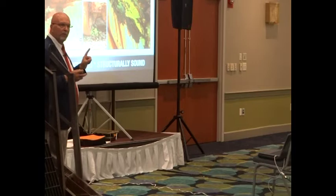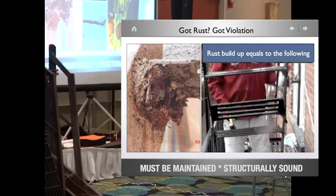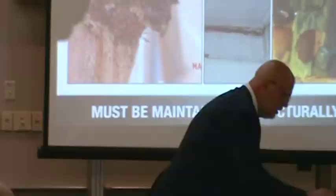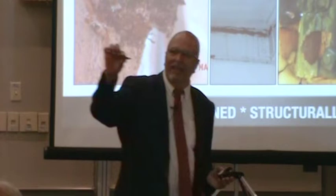So this fire escape took 50 years to get this way. Nobody's ever inspected it, 50 plus years. Again, to grow 1 inch of rust, you need to leave it alone for 50 to 75 years. Now, I told you guys that I do a hammer test. So when there's a hammer test for our safety, when I go up this rusty fire escape, it looks at the ceiling, and some of these bolts inside are like this. I'm sorry that you all can't see, but you're all welcome to come up here afterwards. It actually looked like that.